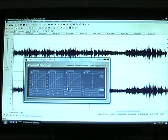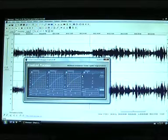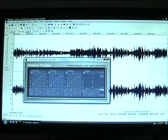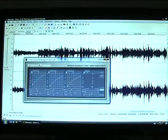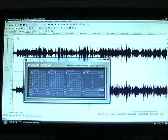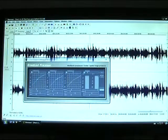So obviously if you compress some audio, then you actually reduce the level, and so having reduced the peaks as you do with the compressor limiter, then you can add some gain, which increases the average level and loudness of the audio. So let me show you the effect of this. Right now we're just looking at the uncompressed waveform, and we're listening to it in that form as well. If I switch in the processing, you can hear it's immediately become much louder.